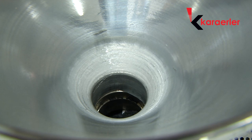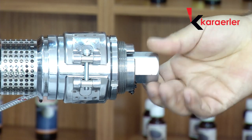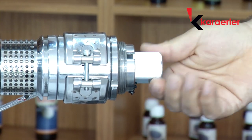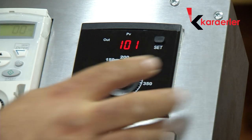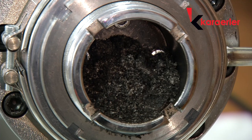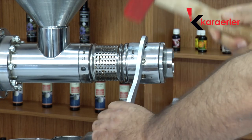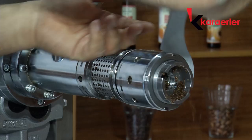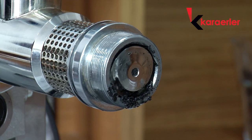When the shaft appears while the seed is almost finished, after drawing the desired amount of seed, we stop our machine and remove the nozzle. We bring the thermostat temperature to 0 degrees and remove the nozzle at the front side. We start our machine again and wait until pulp appears at the front side. We must strictly do this operation because it depressurizes the machine head — otherwise, the head cannot be opened.